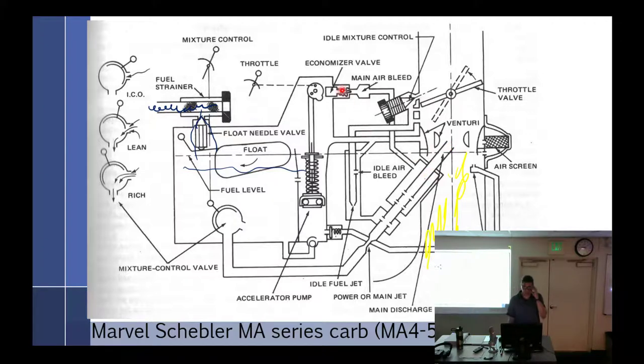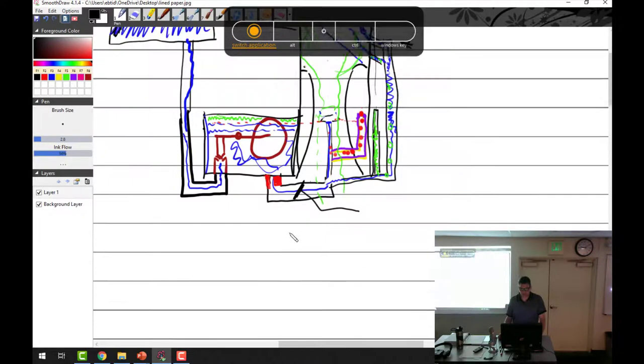The big old carburetors — like the MA45 on my airplane — have an economizer. But all the smaller ones — MA3 SPA, MA3s, MA4s — not the 4-5s — they don't have this economizer thing. We'll talk about that later. Your carburetor won't have this; you're just going to have a spot where it pulls in bleed air from behind the Venturi and mixes it up.